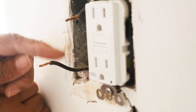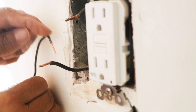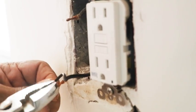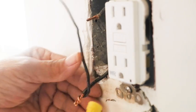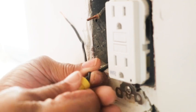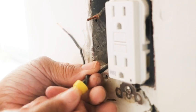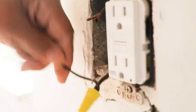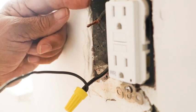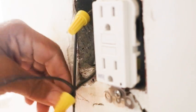I'm going to take the wire that's coming out of the box here and marry it to this piece of wire that I just cut. Now I'm going to take a wire nut and put that right there, and screw that on really good. Give it a yank — okay, so that's installed. I'm going to repeat the process on the top wire. I've got both my wire nuts connected, the top one and the bottom one.